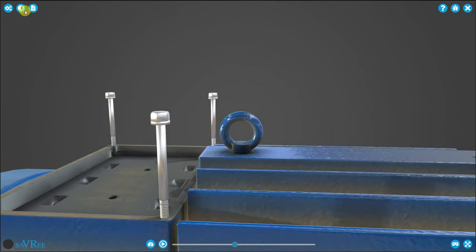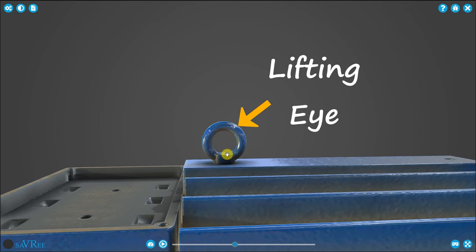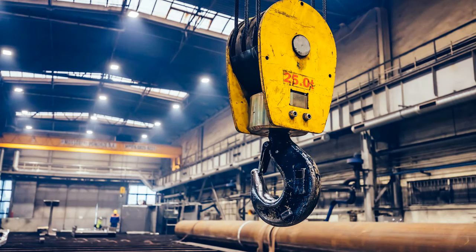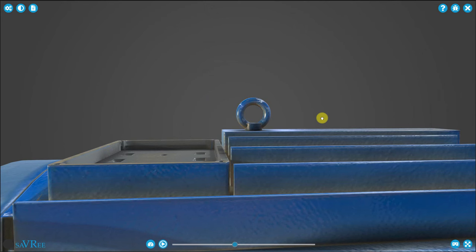On the top of the frame we've got a lifting eye. The lifting eye allows us to move the motor around without breaking our back — literally. If you've ever worked with one of these motors that's quite large, say 30, 40, or 50 kilos, you'll know they can be quite awkward to manhandle. I really do suggest that if you are lifting these motors, you keep a straight back, because if you lift them incorrectly you're most likely going to injure yourself. Nowadays, if you're working in a professional manner, you should be connecting a chain block, hoist, or similar mechanism to lift the motor, to prevent injuring yourself or anyone else.